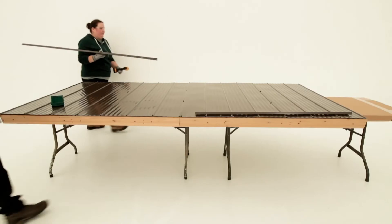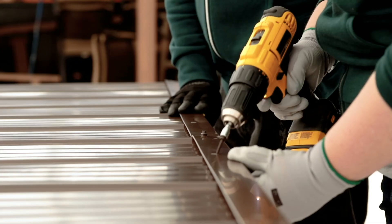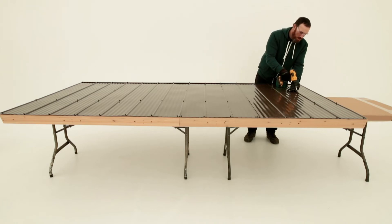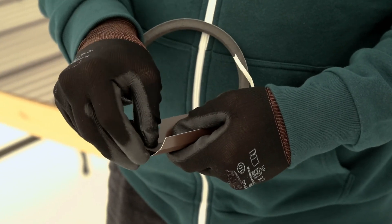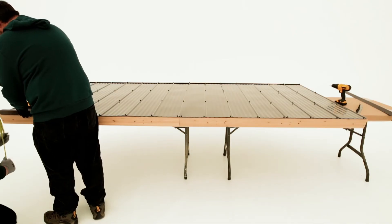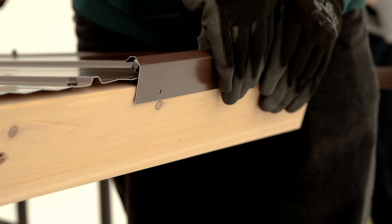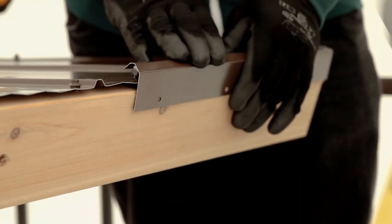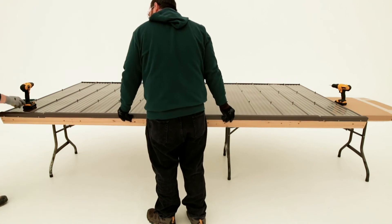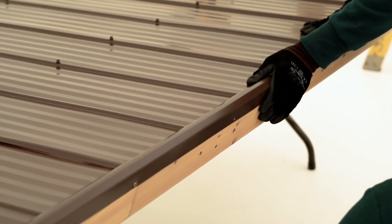Step 8: Attach Roof Panels Parts 2 to 4. Position a roof edge left and roof edge right along the bottom of the panel assembly. Make sure the ends meet tight in the center, secure the three middle screws, then work your way from each end inwards. Next, finish securing the panels with roofing screws. To complete the panel assembly, peel away a small portion of the backing on the strip of weather seal, then begin attaching it to the rounded bottom of the ridge clips. When you're done applying the weather seal, attach the ridge clip 15s to the top of the panel assembly at each side so that it aligns with the angle of the rafter top and is flush with the side. Take care not to push down on the ridge clip. The bottom of the clips should be 2 and 3/4 inches from the bottom of the ridge top. When in position, attach it with screws. Place the ridge clip in between both ridge clip 15s, so it aligns with the angle of the rafter tops and the bottom of it is 2 and 3/4 inches from the bottom of the ridge top. Then secure with screws.